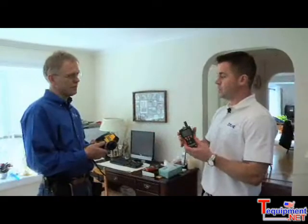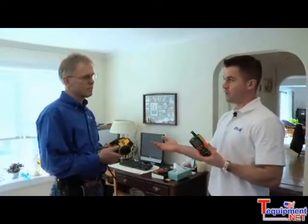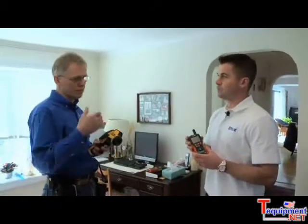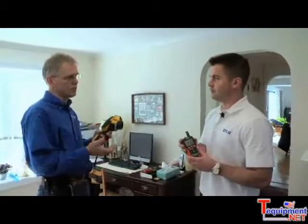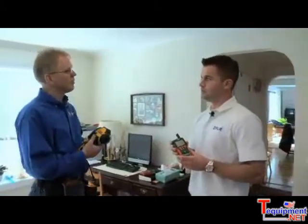Whenever you save an image with the infrared camera, you'll also get the moisture reading, and that information will show up in the report that you provide the customer. This is a great improvement because in the past, we didn't have that link between them and you would have to make a special effort to make sure you got the moisture numbers written down. Now it comes right on the image — it essentially automates the process. We build a report with that image and it'll never be forgotten.